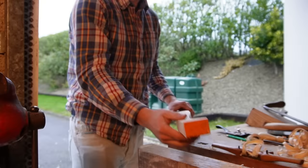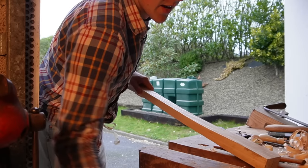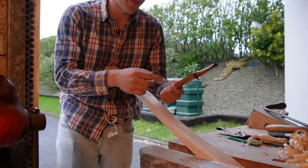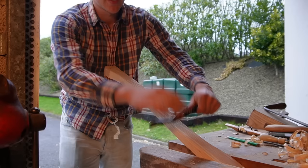So once I'm pretty happy with how thick it is, I can just throw it back into the vise. But this time I'm going to work on rounding over the corners, as opposed to making it any thinner. I don't like to use the wooden spokeshave at the start just because those tough edges can be rough on the sole of the spokeshave, so for that I'll switch to the metal one just while we start rounding everything over.